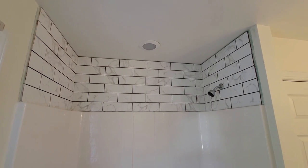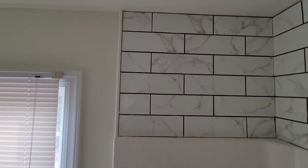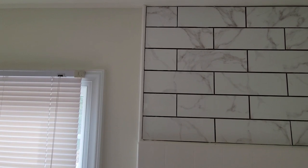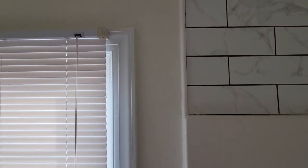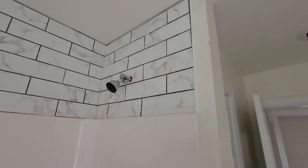That's it for the day — we got about five hours in. Of course we didn't know what we were doing and had to learn as we worked, but we're really happy with it. Last night I came back up and put the pencil trim on. This is simply half-inch marble trim, the same kind I used in the downstairs backsplash project. To put it up I used Gorilla Glue and it went up very nicely. I then put white caulking on the side to finish it off.